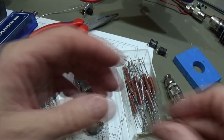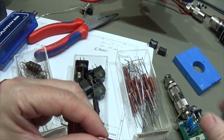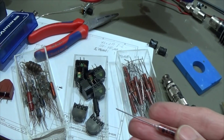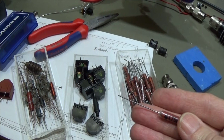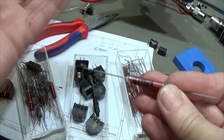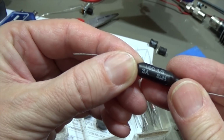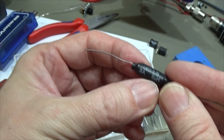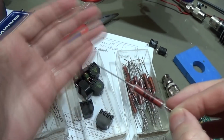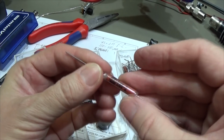So what can I do? What we can do is check if it would work in circuit, and if we can prove that it works, then of course we can go for a new choke which is able to handle, let me say, 1 amp. That would be fine. I have one here. This is able to handle 3 amp, but only 8 microhenry, and that is not sufficient. So I guess we put this in just to prove that our considerations are right, and then I have to order one. No other way.